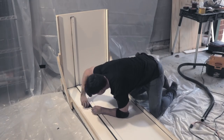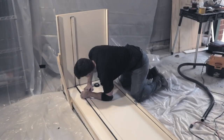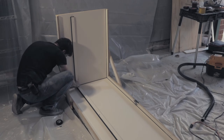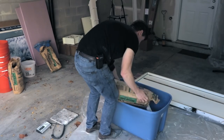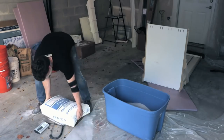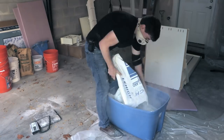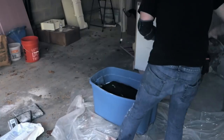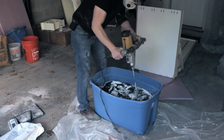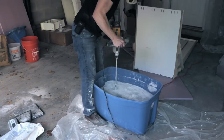The melamine molds for the LED channels had exposed sides, so I went back and covered them with electrical tape to prevent water from getting into them. Then it was time to mix some concrete. For this build I used a from-scratch glass fiber reinforced, or GFRC, concrete mix. Because we wanted the face coat and back coat to be a consistent color throughout, we mixed up 280 pounds of this all at once in a big bucket.